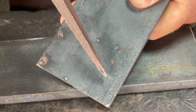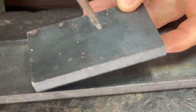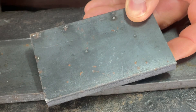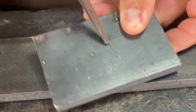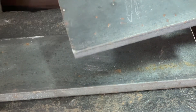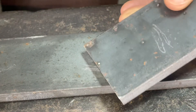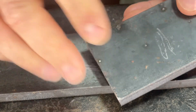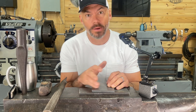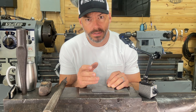See those specks of rust? Those are arc burns — that's where the mill scale was damaged. Everywhere that it's pecked like that, it's going to rust. Look at how thin it is — it's gone. That shiny metal is right underneath. If this was from China, it would look like used motor oil. But this is good U.S.-made steel with a thin coat that is not going to bother you. You can weld that all day with just about anything — even a MIG gun with hard wire will blow that off. We are welders, not grinders.